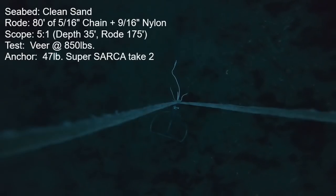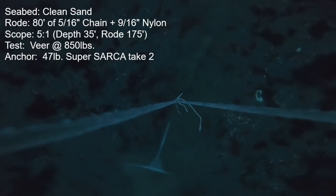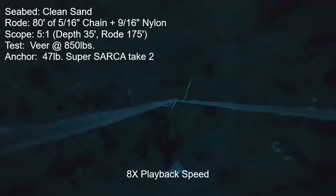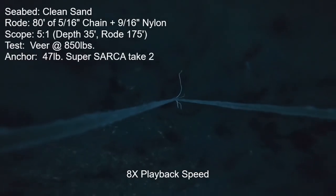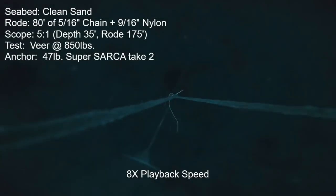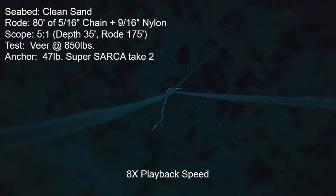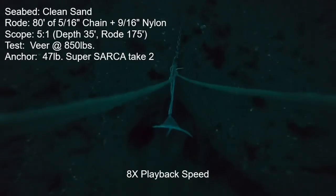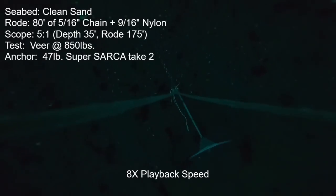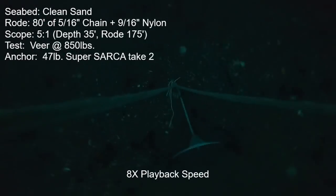Here is take two for the Super Sarka anchor. Note it's pointing straight up as it landed and is now being tipped upside down — we get a great view of the roll bar in action as the anchor just pivots right around and sets with no problem. There is not as much seashell present in this segment of the seafloor. It did not matter — in fact the anchor might have done a little worse on this one, though it's really too close to call. There was continuous motion through the 180 degrees of veer without a full release, although I did feel a couple of big lurches during the veer. During the straight-line portion, the same story — continuous motion — and at the maximum 1,325 pounds the boat was moving at 0.5 knots on the GPS.